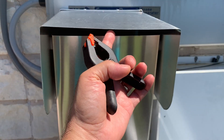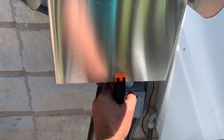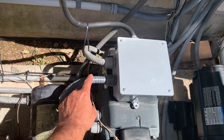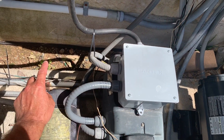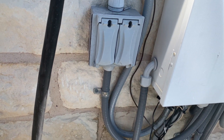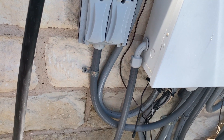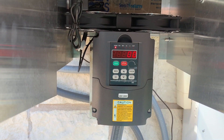I'm going to close this box now — as you can see it slides down just like this. I'll probably put a piece of magnet in here so when you open it, it just attaches right there and I won't need this clip anymore. The wiring inside is three-phase. The power that comes from the Blue Heaven goes through this cable and comes inside the box, where it connects to the five-wire cable: three wires carry the three-phase to the motor and two wires carry 240V to the inverter.